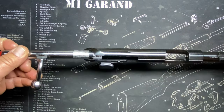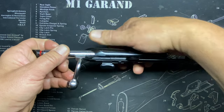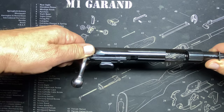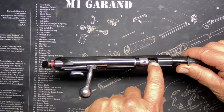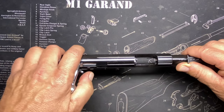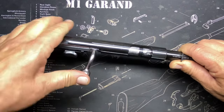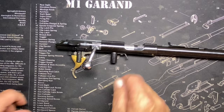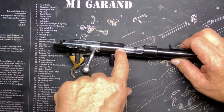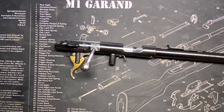When putting the bolt back together, you have to make sure this recess on top is lining up directly with that clip. If that's lined up, the bottom is lined up, and you just push it straight through. You have to pull the trigger to get it past a certain point. Be very careful to make sure it stays straight — it's coming out facing the right way and riding in the channel. If it wasn't, you'd just bend the ejector down with the bolt.